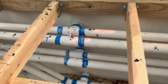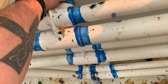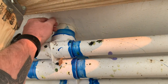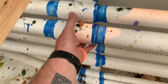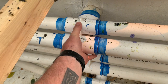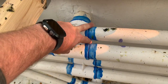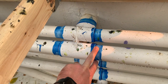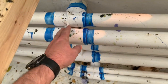Each of your jets are going to stick out through the wall, and it's a 2.5 inch pipe that comes out of the wall. You're going to need to get these — I call them jet housings. It's one big piece, and it has an inch and a half for the air and 2 inches for the water, and then the 2.5 inch end there.